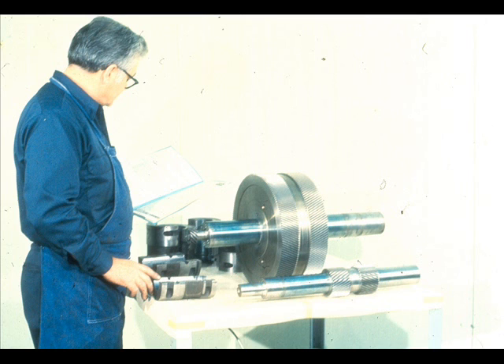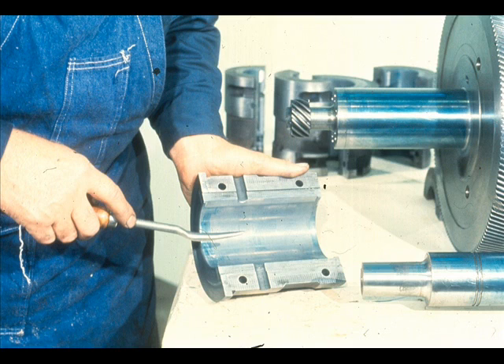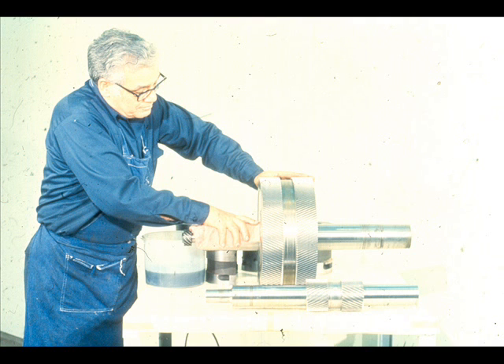Then double-check the contact pattern against the specifications set forth in the manufacturer's manual. The manual may show examples of acceptable contact patterns, or it may simply specify the percentage of contact required for efficient operation of the bearing. If there are any high spots in any of the bearings, they will normally show up similar to the spot being pointed out here by the workman. This may often be remedied by scraping the high spot, then repeating the contact check with Prussian blue, to ensure that the contact is within acceptable limits. After completing your checks of the shaft bearing contact, clean all of the Prussian blue from the shaft bearing journals and from the sleeve bearings.